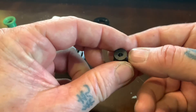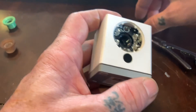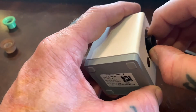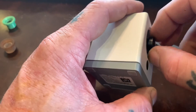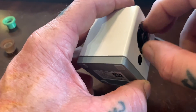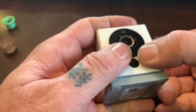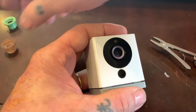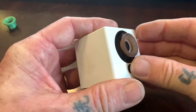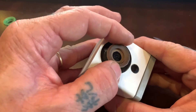That's pretty much all there is to it. Once you've got that done, you need to put the lens back in — screw the lens back in very gently and carefully, as the threads are super fine. Then go ahead and put the black cover back on and it should just pop right into place. From here, take your lens to your focus ring and push it on all the way. Now you'll be able to focus your camera up close for your 3D prints.